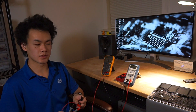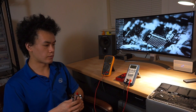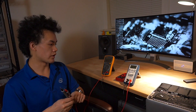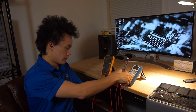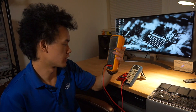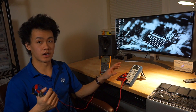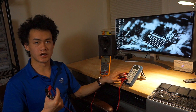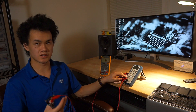You want a high internal resistance because, number one, it prevents shorting out the circuit. Because electricity takes the path of least resistance, very little electricity flows through the multimeter — just enough for it to get a reading. When I put the multimeter into current mode, the internal resistance is extremely low, almost zero ohms, and that creates a short circuit. If you put the black probe on ground and the red probe on a power rail in current mode, a lot of electricity would flow through and you'd get a short to ground, just like in a previous video.